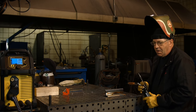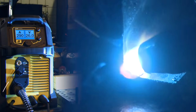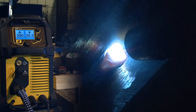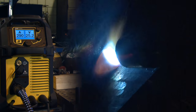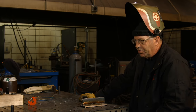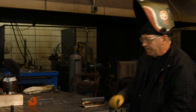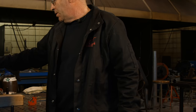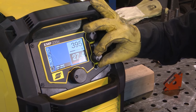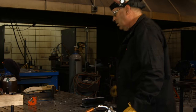As I was looking at the arc, this wire just turns into a needle right as it enters the arc stream. I went down in wire feed speed and it seemed like I had more crackle — maybe I need to be down at 390 inches a minute or up a half of a volt. I'm going to go up half a volt and go on the backside. I want to cool this off — it's a fairly small part, fillet weld on 3/8 plate. I'll go up half a volt and leave it at 395 inches a minute.